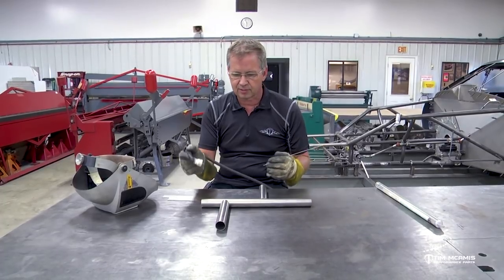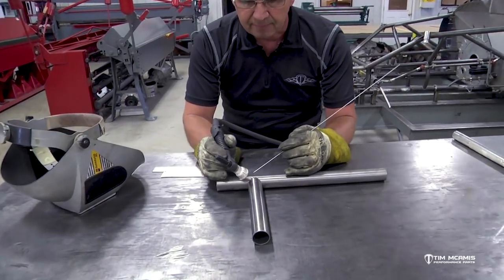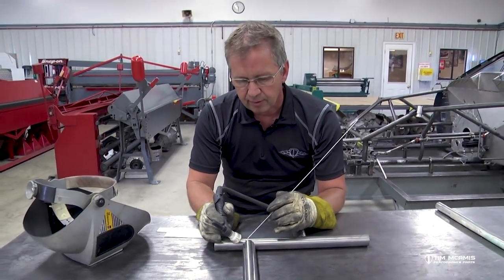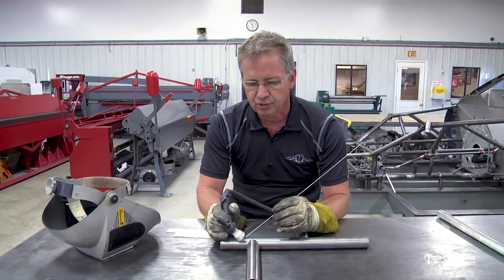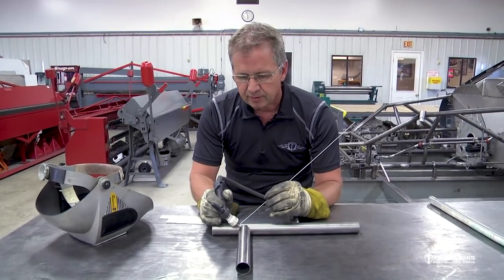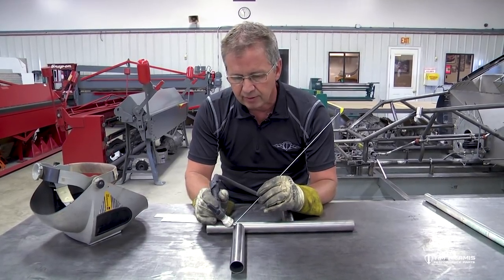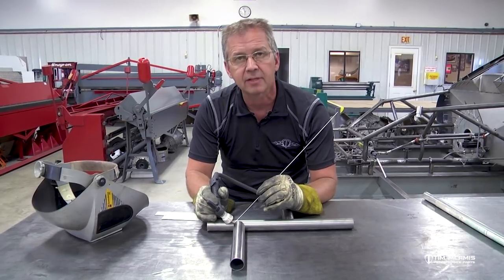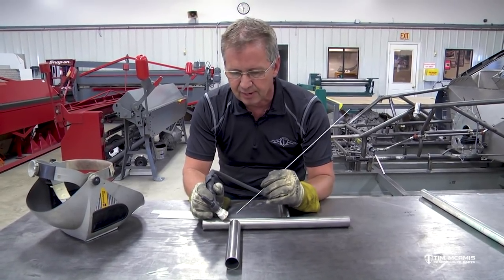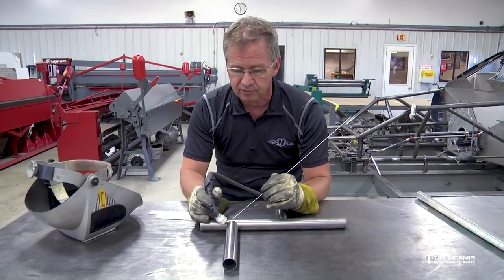As far as the weld process, it's just like welding 4130. Start your puddle, dip, pull along — it's a little bit sticky when you're doing it. When you're using the ER70S2 rod on 4130, you kind of touch it and it just drips in there and it's nice and smooth. The titanium feels a little sticky and sometimes you'll even stick the rod in the puddle. You'll even hear it pop when it comes off the end, like it's just popping the end of the rod off, so it'll make a little tick when you dip it. It feels like it's trying to stick the rod.